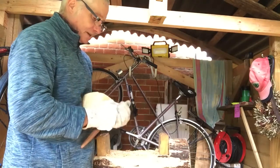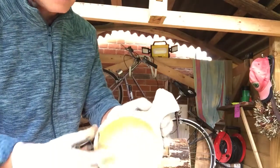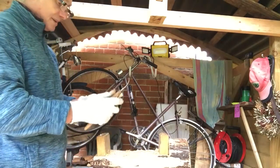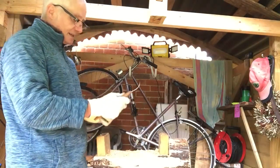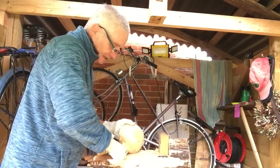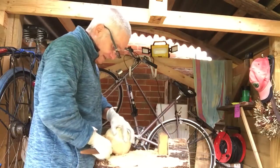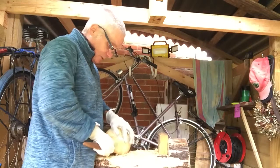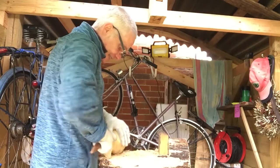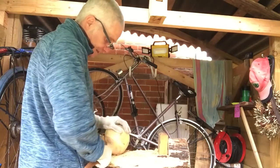So there we go. I've just cleaned that up a little bit, just a little bit to go to get the final shape, but now the weight of that tail is much better, a much better balance. Now, the other thing I said, we need to go under here. Again, we'll be carving at right angles to the grain, but with the Robin Wood, we can use it to really quickly remove this messy material here, planing away like that at 90 degrees.